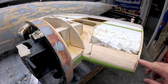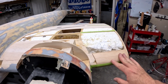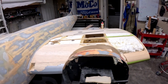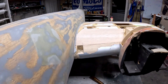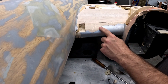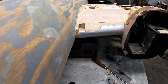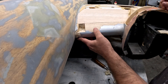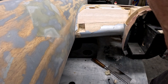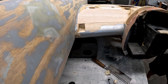You can see the leading edge piece — it's rough shaped still, I haven't done anything with it. I don't plan to do anything further with the leading edge until I get the skin on. Here at the leading edge where the break was, we've got the hardwood dowel coming into the original leading edge and also into the leading edge that is inside the fuselage. Instead of trying to replace the whole piece, you're going to end up with a seam there anyway, so there's not a lot of reason to replace it.